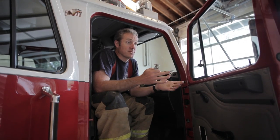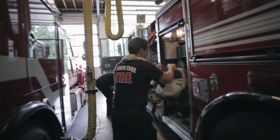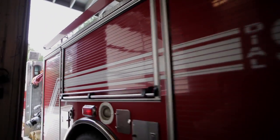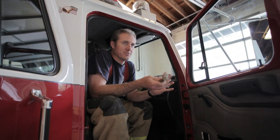Typically, residential sprinklers give off about 40 gallons per minute. It takes 30 seconds for it to respond to us, so that we get the page. It takes us a minute to get dressed and out the door. That's a standard that we have. And then you're looking at anywhere from 3 to 5 minutes, depending on where you are on campus and what floor, things like that. So you're typically looking at about 6 minutes of response time. So 6 minutes, 40 gallons a minute, you're looking at 240 gallons of water that's flowing freely into your room.